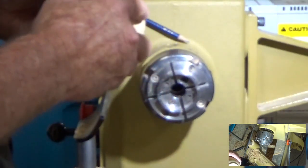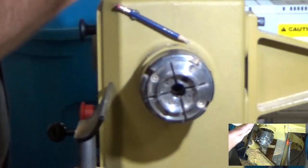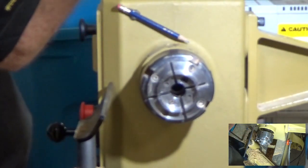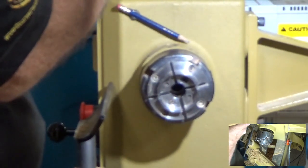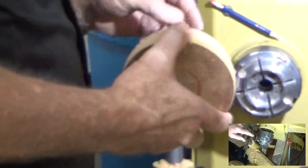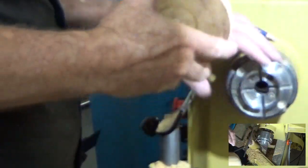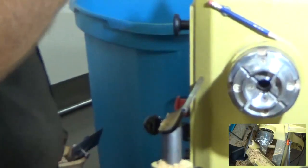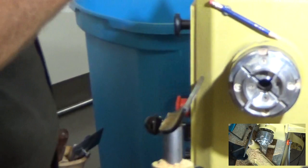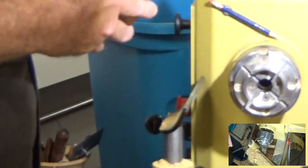On this one, it's just less than 1/4 of an inch. But the foot I put on it is only about 1/8 of an inch, so that way I catch hold of more material. On the dovetail jaws, you don't have to have as much to grip onto as you do if your jaws are straight. If you have straight jaws, you better go probably 1/4 of an inch.